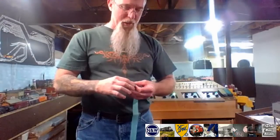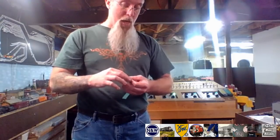Let me back up. The value in CV6, which is midpoint, might be 150. But if they go and program 2 to be 170, well, that's more than 150. Then your decoder is going to do weird things. It's going to jump because it's a lot of voltage, but it might not work at all. It might act really weird. You just never know. You can get unpredictable results.